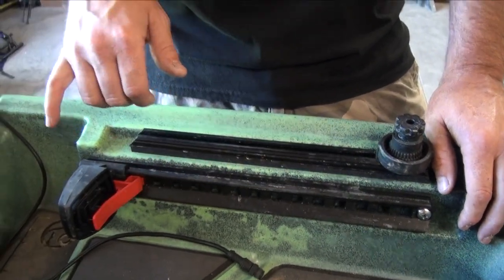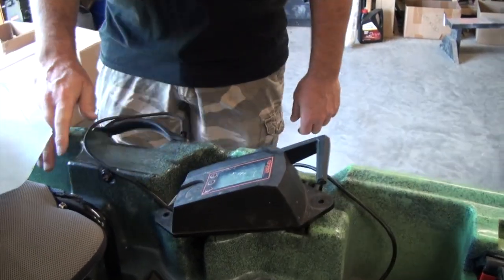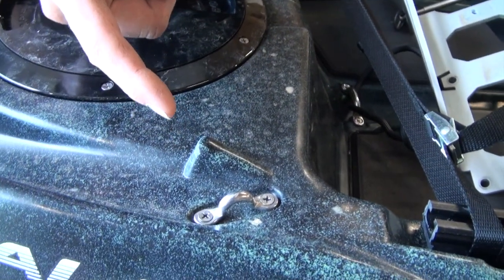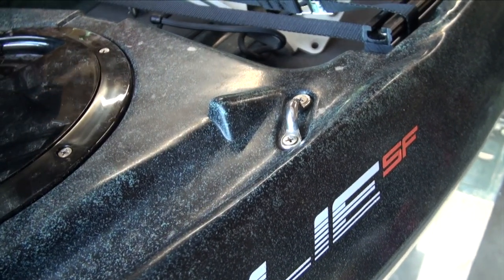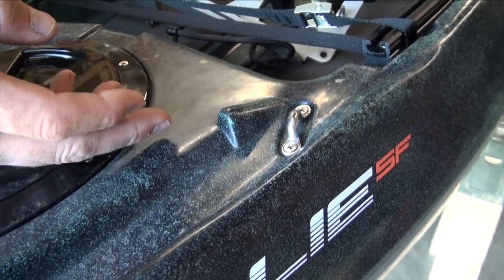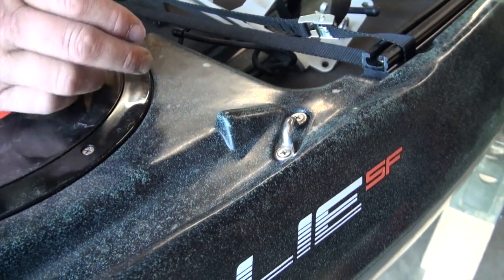We'll install tubing into the hole and the throttle mount — we're using a flush throttle mount. The tubing will come back here and most likely come out in these molded outlets. The cord and tubing will come out here for a rudder or motor install. It's nice that they've incorporated that because it makes it a lot easier to mushroom the tubing. You can drill an angled hole into the plastic, but when you go to mushroom the tubing it gets kind of weird and tougher to do. This makes the install a lot easier.